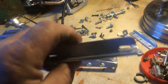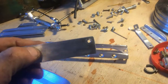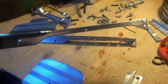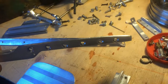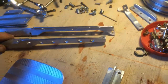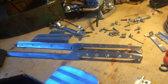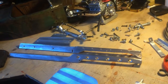I wanted to come up with something that you could buy readily. This is called T-metal - it's basically a T shape and it's what I've made everything out of. I've machined these out with my die grinder and cut them down, but they're still T-metal. I started out using self-tapping screws just to get things set together, and then once I got everything fit right and clamped together I replaced them with good stainless Torx.